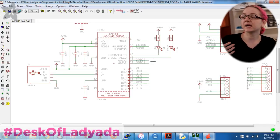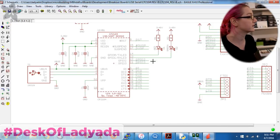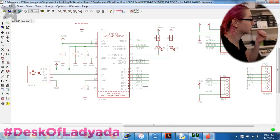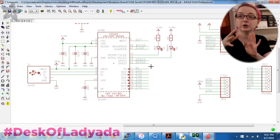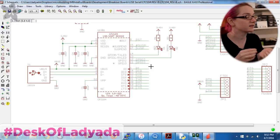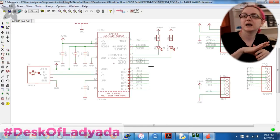And so the question is, how do you use them? There are these pins that you could take advantage of, maybe do something with. Let's say you wanted a separate signal that was not one of these, like you could use it for bit-bang controlling something or doing a manual reset where you don't want to use the RTS or CTS lines. So you can use these as inputs and outputs, but there's no part of the USB serial interface that gives you access, right? The RI pin and the RX and TX are controlled by the CDC, the default USB data communications standard, right?